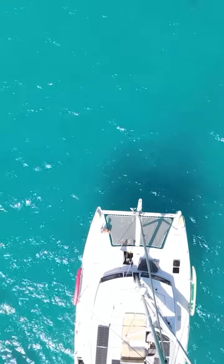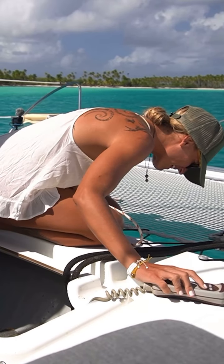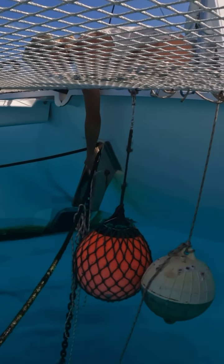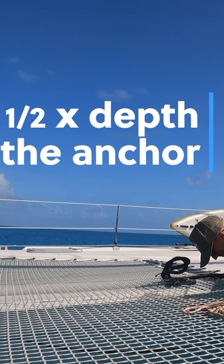There is a little science behind this practice so as to not hinder your anchor's ability to dig in and get a good hold or footing in the sand — and luckily it's not complicated. All you need to remember is to hang your first ball, or the one closest to the anchor, at least one and a half times the water depth from your anchor.